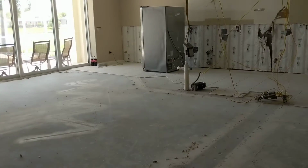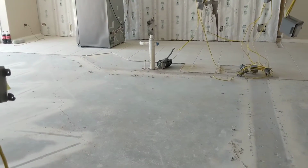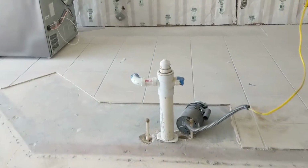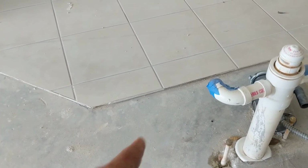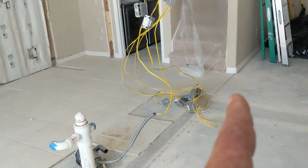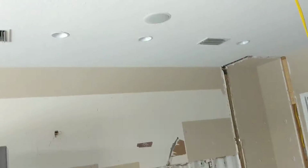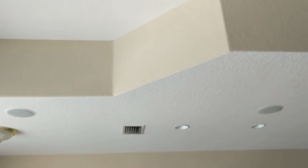As you can obviously tell, this is now a big open floor plan. These are the plumbing lines I said in video 1 that have to be moved. These lines are going to get moved roughly right about there. That's going to back up the cabinets, and we're going to stretch them down starting 45 inches off the steps, and put them lengthwise here. And then of course we still have to extend this roof line, the ceiling line. It's going to come down further and then turn back in again.